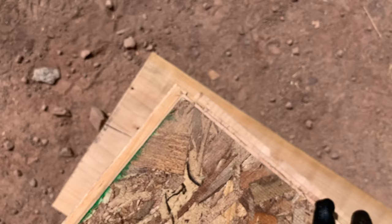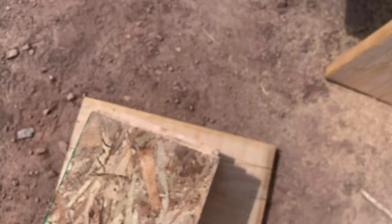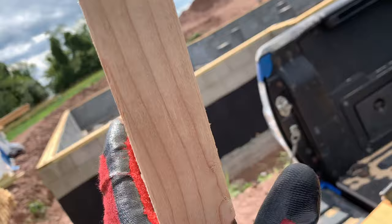Just try to lay the sheeting flush with the edge of that board. When you cut the filler strip, cut it a little bit shorter and thinner than the actual wood board you're using for the header, so you're not fighting with it sticking out of the edge. Same thing — look for the cup on the second board.